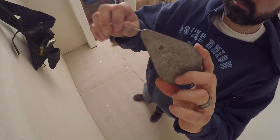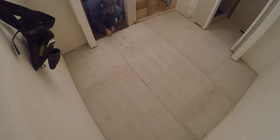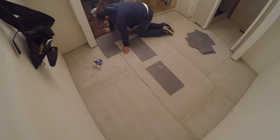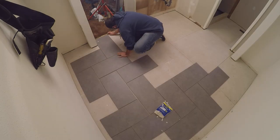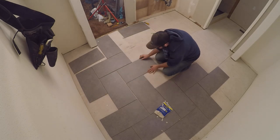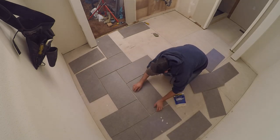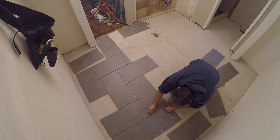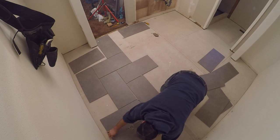Using an old chalk line I inherited from my wife's grandfather, I marked a line that was in the center of the doorway — this would make the tile visually symmetrical as you come in the room. We tried out a few different tile patterns but ultimately decided on straight herringbone. I laid out all the tiles working from the back of the room to make sure I had a full tile front and center, and to avoid weird sizes around the perimeter. It took some time to get everything adjusted and marked down, but it's worth it.